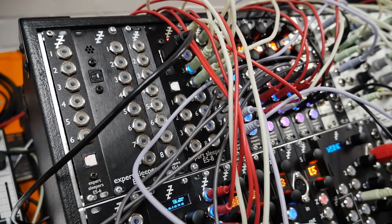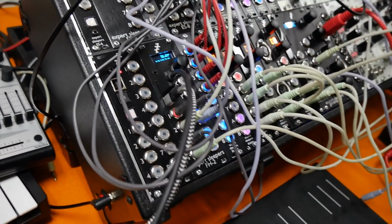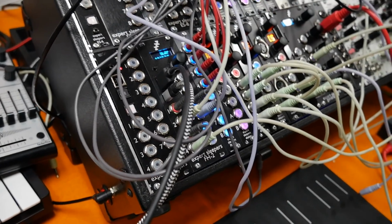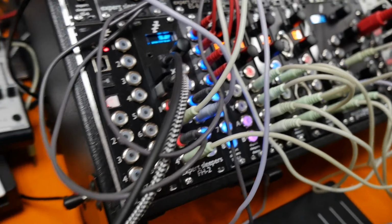The thing with audio is that the delivery of audio from the computer is this very carefully engineered system that guarantees that all your audio arrives in a sample accurate way, because if it didn't, your audio would sound like total mush. Whereas the MIDI system in a computer, the USB system, is designed for mice and keyboards, right? So you don't have that guaranteed delivery if you're using it with a computer. If you're talking about embedded hardware, like the device itself or one of these other dedicated bits of MIDI gear, you can have much tighter control of the MIDI timing. You still don't have that guaranteed scheduled delivery you get from audio, but there's no reason it should be as bad as it would be from a Windows 7 laptop, for example.